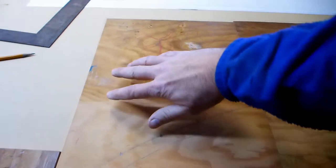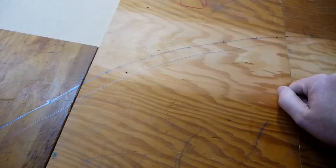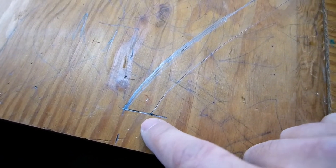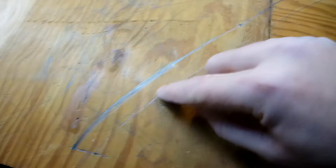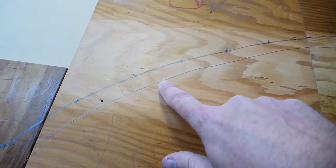I just put a little mark at each of those spots and then free-handed a curve around there. What's kind of annoying is that those measurements go to the outer edge, and you're probably not going to make a form out here and push the tube into it - you're probably going to make a form on the inside and bend the tube around that. So I just took a piece of material about 5/8 of an inch, the size of the tube, held the pencil up against it, and ran the piece along the line to transfer the mark in 5/8 of an inch.